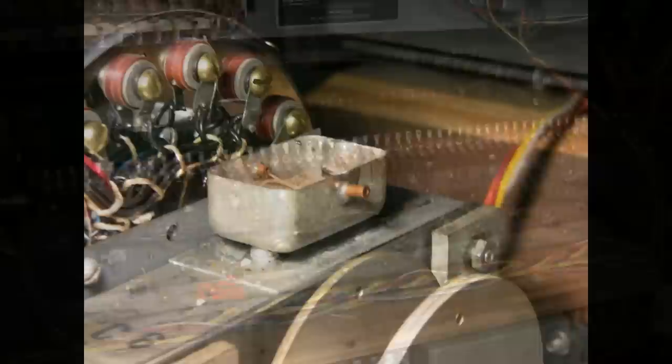This missing oil wick is common with Hammond organs of this age and older — this one being manufactured in 1964. They either deteriorate with age, or get entangled somehow, which with the nearby flywheel is probably what mine did. This organ has been moved and hauled all over the country and has been turned on its side to fit through doors and a few other things, so that may have contributed to the cause.